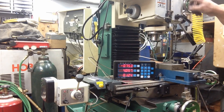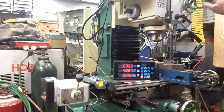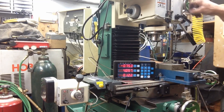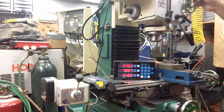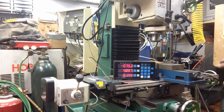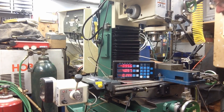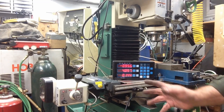For this application and manual machining, repeatability is not that big an issue. The X-axis should be moving and we'll have to reset direction on part of these. I do notice the Z-axis bounces a little bit - it actually zeros out - it's the machine itself coming back up rather than anything with the readout. I noticed the variation even before we mounted the digital readout. Anyway, we have a functioning digital readout - we've got to get it set up, figure out how we're going to mount the head, and then this is one more thing done.